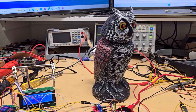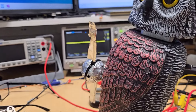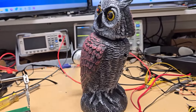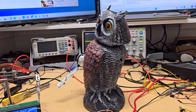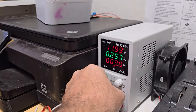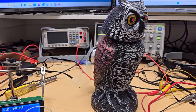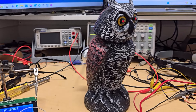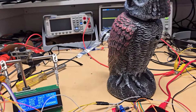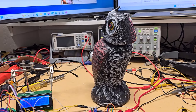When I put the foil on there it adds load because it's swinging that through the air, which has mass, so it moves but it's quiet. I'm going to try turning the on-time up a little to get the motor a little more speed - maybe 400 milliseconds on time instead. It still doesn't get up to speed very well. I had the current limited - it was hitting the current limit, so I turned it up. More current actually has a little side effect of a noise, a little knock sound to it.